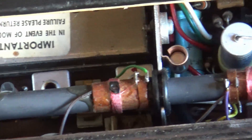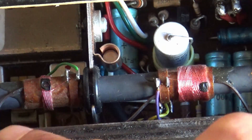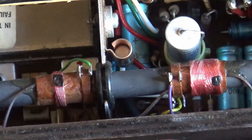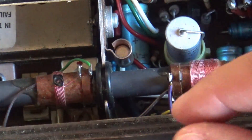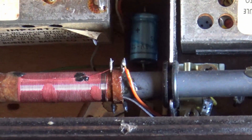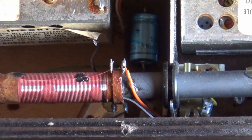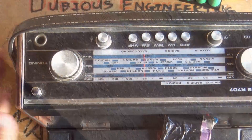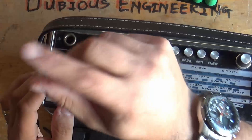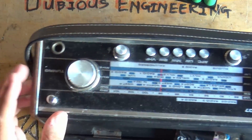Let's have a look in the back. There's a lovely ferrite rod here with various different coils on it. The idea of this ferrite rod is it collects the radio waves and directs them into the coils — effectively it's like an internal antenna. That's used for the short wave, long wave, and medium wave frequencies, and then obviously the antenna on the top is used for the VHF FM frequencies.